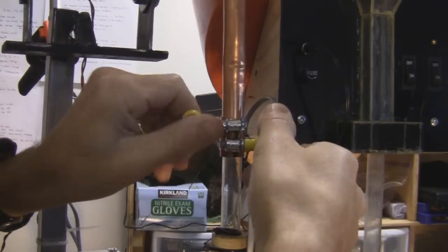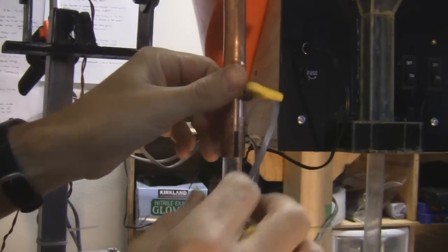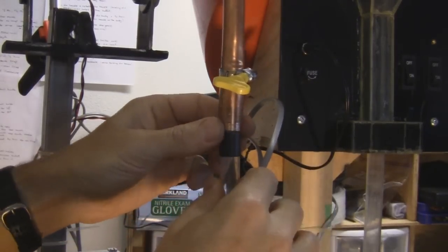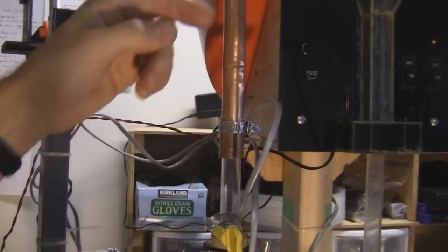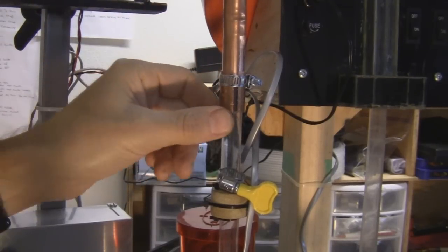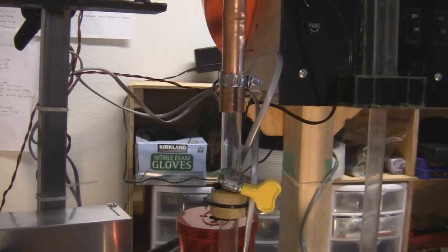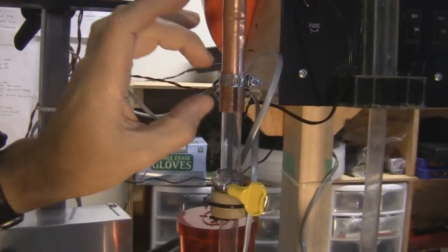You want a very smooth connection between the pipe and the plastic. I put a bit of black tape on the half-inch copper pipe, and use two hose clamps to keep it tight. You want the bottom sensor to be a little way from this joint, because if the bullet falls and gets caught up for a split second on a ridge, the sensor could sense it for a longer period and think there are bullets below — potentially triggering the motor to turn off. I do have a delay in the electronic circuit that helps rectify that, but just be aware of bullets getting caught up as they fall.